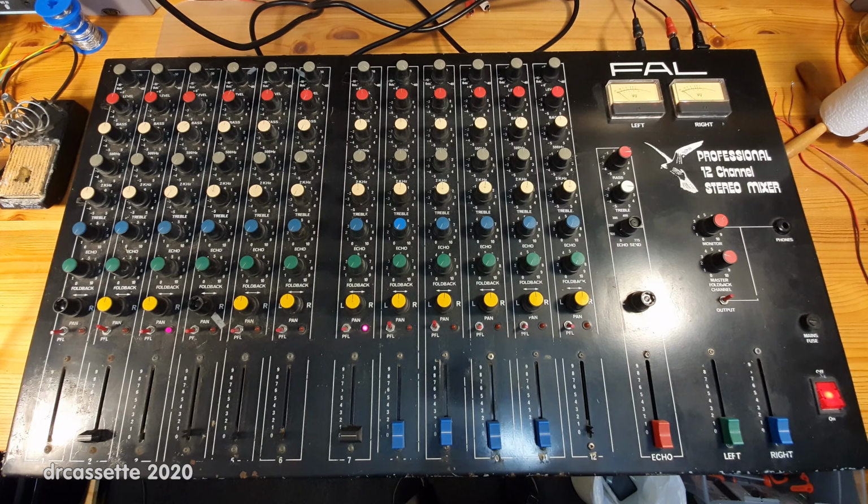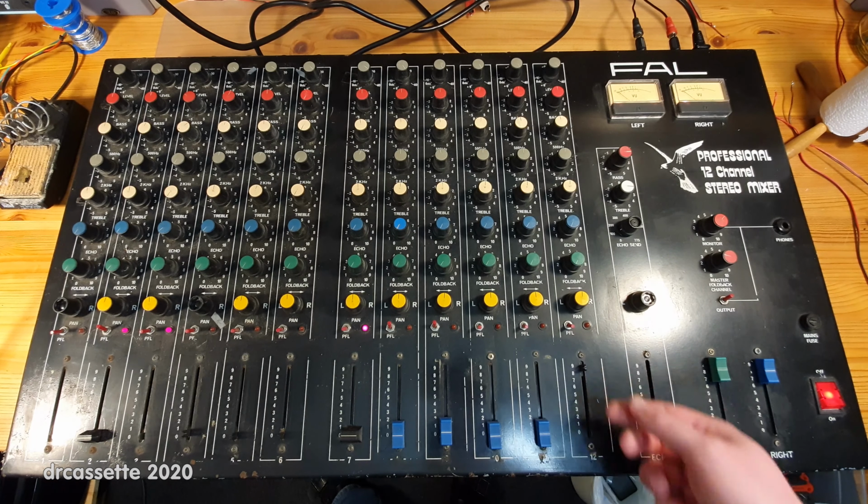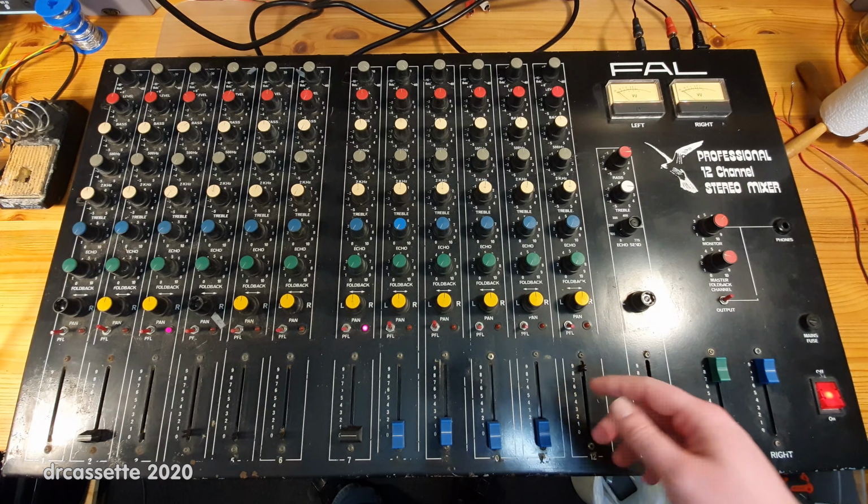Initially, there is silence, but that is because I have the master faders turned down. So if I bring those up, you probably won't be able to hear that, but there is now a bit of mains hum. And now, let's go through the channels. Now, if I bring a channel up, you can probably already hear the white noise. And that is, of course, very much dependent on the level setting, the input amplifier. So let's bring in another one. And another one.